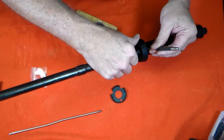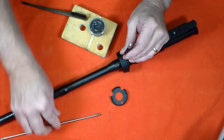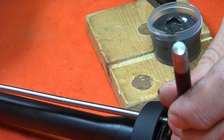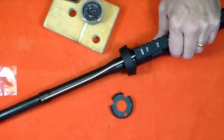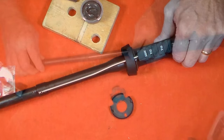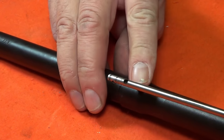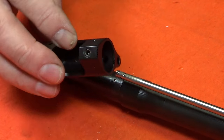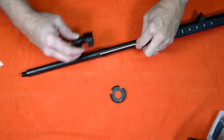Here, I use the punch to line up the holes and the spring for the gas tube. There are two holes in the gas tube — the large one has to line up with the hole in the bottom of the gas block and the hole in the barrel. If the gas block is properly installed, I only have to press it on tight to get it to line up.